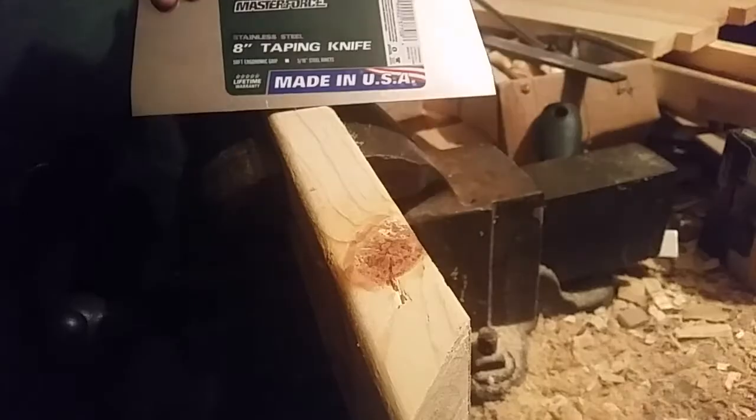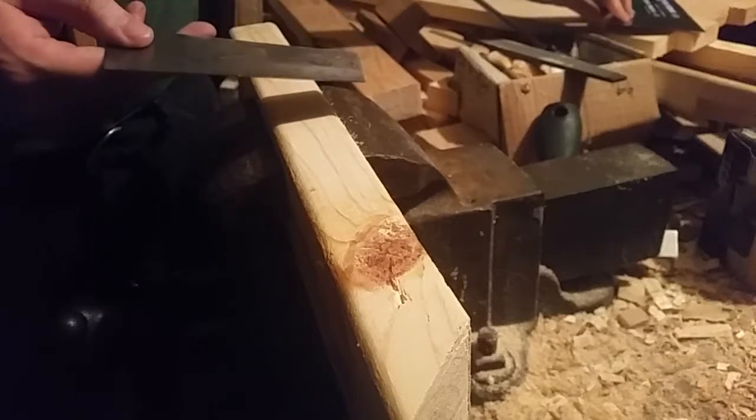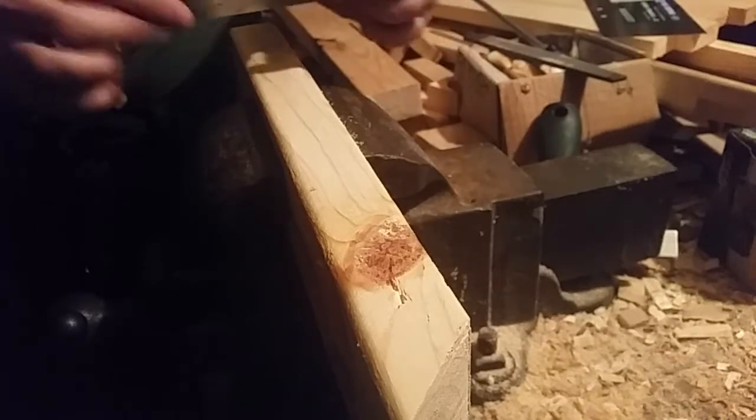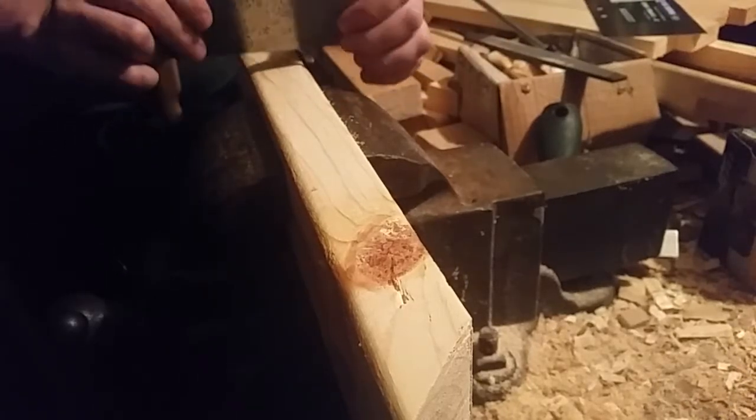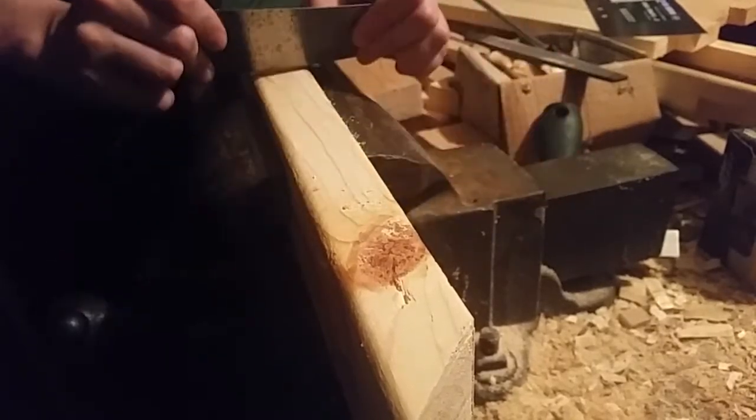That will take a much heavier cut than only setting the burr right on the edge there, because you've essentially extruded the metal twice, one from this side and one from this side. So let's see how that performs. I have a burr turned on this, but this is the thing that I'm replacing. It doesn't really work. So to show you what I was starting with, let's do a couple runs with just this.